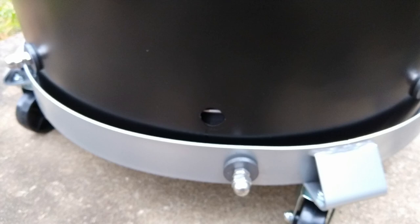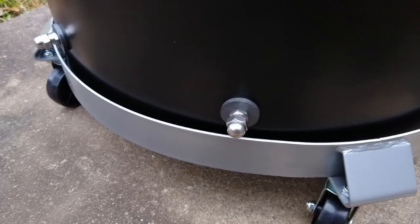There are a lot of different ways to do airflow control — some people use ball valves and really complicated setups. I found on my original one that just three-quarter inch holes was all I really needed to control the air coming into the smoker. My original smoker had four holes; on this one I used eight, just in case I want to run it hot. You can jump the temperature up by allowing more air in, so I added the extra intake holes.